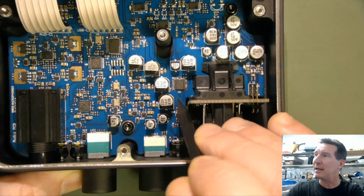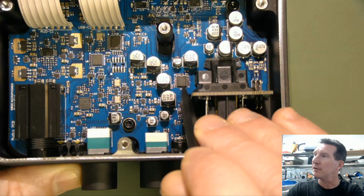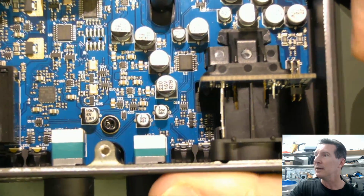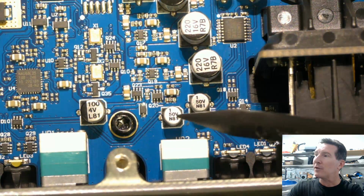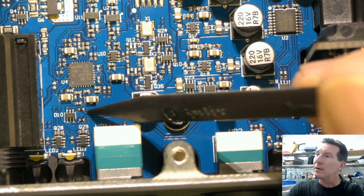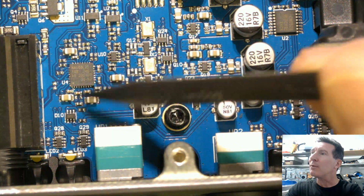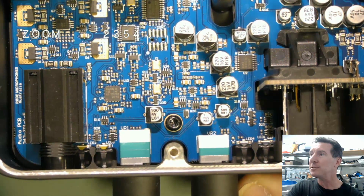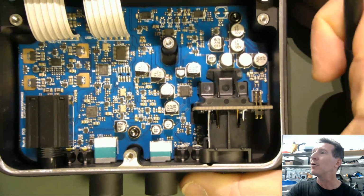And then it comes out of here. Follow the money out of here, balanced line over. Got two 50 volt AC coupling caps in here. You can see that they're in series with the line. That's how you can tell they're AC coupling. Going over here, I'm not sure what that is. Got some pull-ups, have we? But anyway, it's then going directly into our main chipset over here, which has the microphone amp and everything else in it. So running that halfway across the board, it's just puzzling.